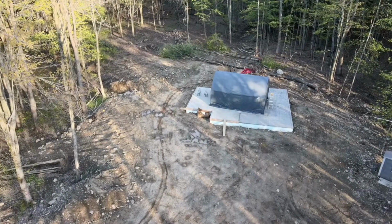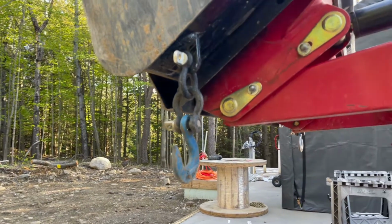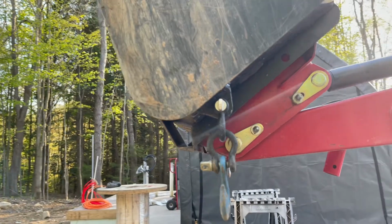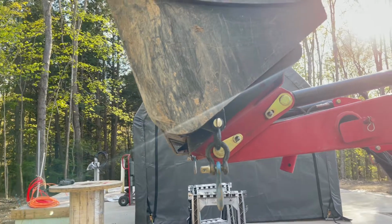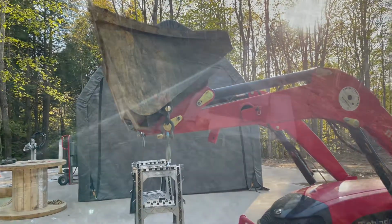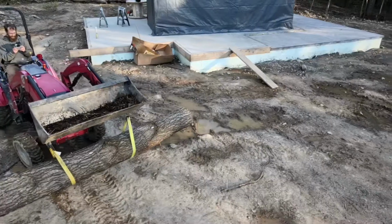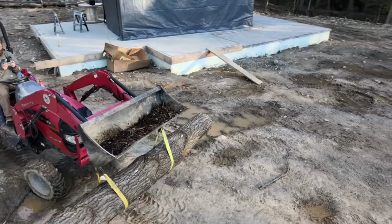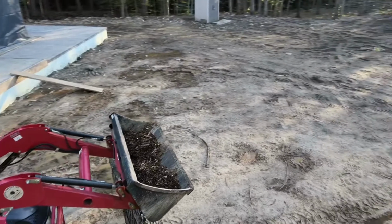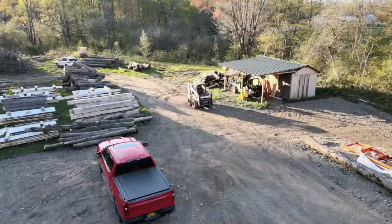Here, I'm going to show another use. I found these pad eyes on Amazon. I'll leave a link in the description. I welded them to the back of the bucket. And right here you can see it moves the center of gravity to right below the lifting mechanism for the bucket loading arm, and that actually increases the lifting capacity quite a bit. If I used forks, I would be limited to about 1,200 pounds or so on the tractor. But with that setup, I can lift the full 1,600 pound rated capacity because I'm right at where the breaking force is.